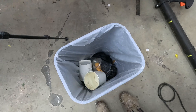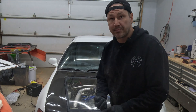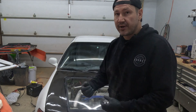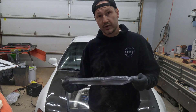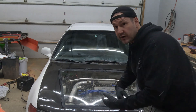I did go with hood pins. The old hood had kind of garbage, ugly small button-style hood pins. I also shaved off the latch and the hood prop. If you're buying one of these hoods, there is no latch or hood prop, so you do have to run hood pins. You also get a gas shock like this — it has little nubs on either end. Just hope that when you order it they send you all the hardware.